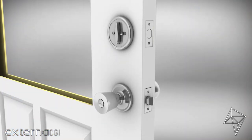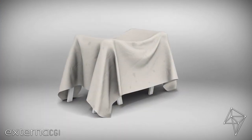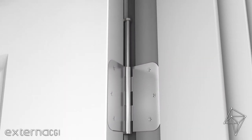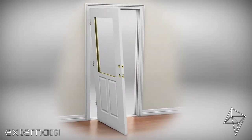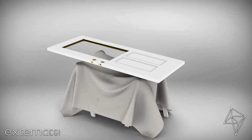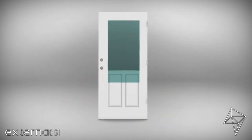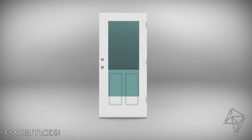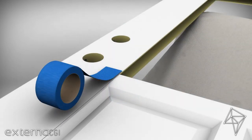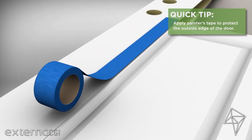Remove the doorknob or handle and any lock sets and carefully set them aside until after the door glass is installed. Position sawhorses with a drop cloth draped over them to catch all debris and protect your door from scratches. Then remove the door from the hinges and carefully lay it across your sawhorses. With your door glass now removed, extend your existing vertical measurements to your new vertical dimensions and mark your vertical measurements from your top horizontal measurement. Make sure your cutting area is centered. Apply blue painter's tape along the outside edges of your cutout area — the tape will act as a guide for cutting the hole and protect the finish of your door.